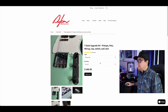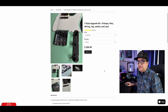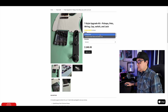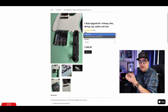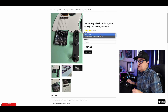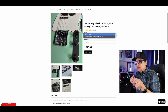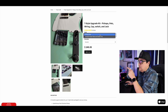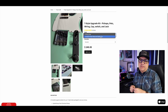Let's talk about our Telecaster upgrade kit. This is where you can get pots, caps, wiring, and the pickups all in one set. You can get the wiring only — soldered together so you just put them on your own plate. If you have an import guitar, some sort of Tele copy, or even some Squiers with seven-millimeter holes instead of three-eighths-inch holes — because we use real CTS pots — chances are you're going to want to buy the included plate and switch tip so you don't have to drill out and worry about that stuff.